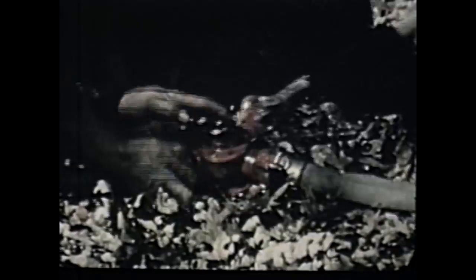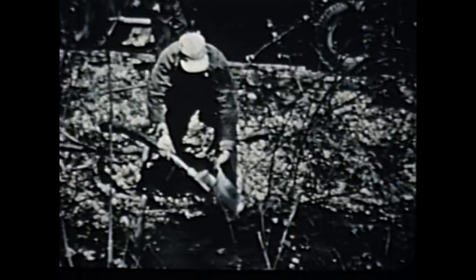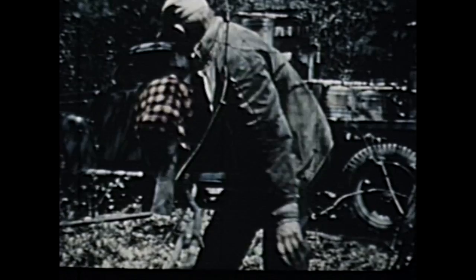In hitting the long hose line, we put our training with the Siamese unit to good use. Back at the tank truck, the crew was preparing a new water supply before the tank gave out. Even a small stream can keep a pumper in operation. The suction hose strainer keeps debris from clogging the water intake, and the bucket keeps out silt.